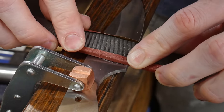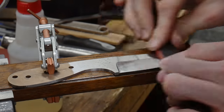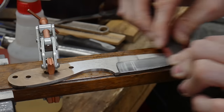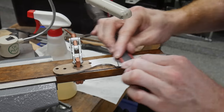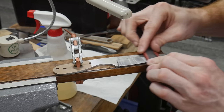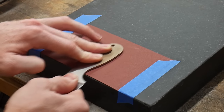After truing up the plunges, I moved on to hand sanding the knife. A hallmark of many custom knives is a hand-sanded finish along the length of the blade. To accomplish this, I again used some 320 grit sandpaper wrapped around my file as a sanding bar. I stopped at a 320 grit finish, however you can take this finish all the way up to a mirror polish if you so choose.